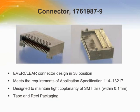The QSFP connector is a 38-position, 0.8 mm pitch surface mount connector available in pocket tape for pick and place applications. This connector is part of the Tyco Electronics Everclear product family, which also includes connectors designed for Mini SAS and SATA applications. It is designed for high speed signal integrity and used in conjunction with QSFP cage assemblies to interconnect QSFP fiber optic or copper transceiver modules to host printed circuit boards.